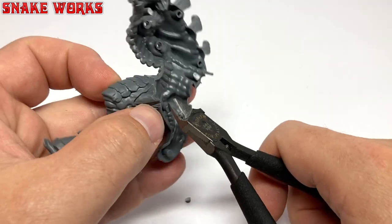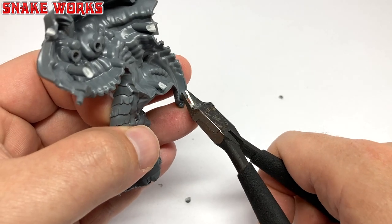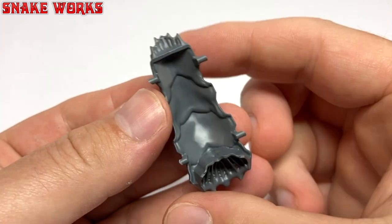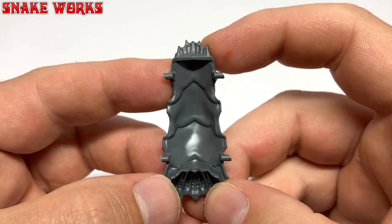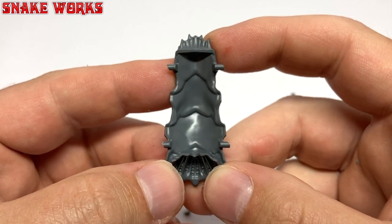I believe the professional term is chamfer - or is a chamfer a type of beetle? Anyway, here's an easier to see example of my chamfering work. You will find the shafts slide into the holes a lot easier if you give them a little pointed tip. They also line up better this way as they slide into position rather than being brute forced in. Some people cut their shafts off completely but I don't dare cut the entire shaft off just in case I need them to locate the parts properly.